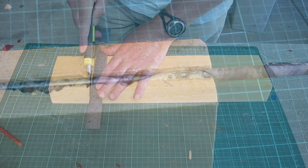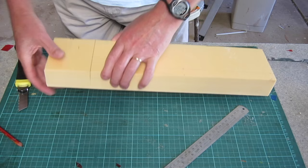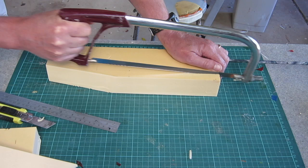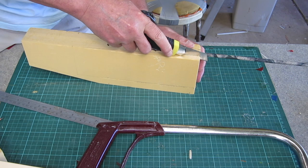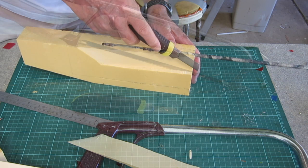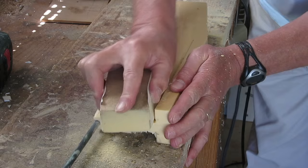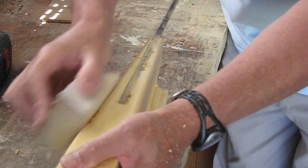Now I'm cutting the fuselage down to 36 centimeters long and shaping down the nose area. I could use the hot wire cutter really well for this job but I'm just using a knife and a hacksaw for those who don't have hot wire cutters. I'm narrowing down the rear section of the fuselage so that the prop gets a cleaner feed of air. A hot wire cutter would do this better, but you can use a knife and saw to roughly cut out the shape, then sand it down — very easy to sand this foam, but wear a mask as it's very dusty.